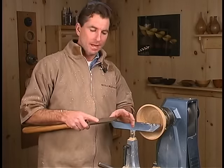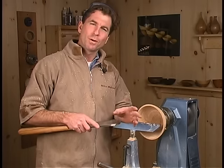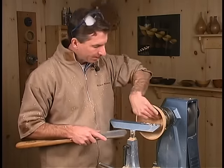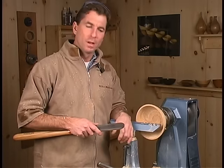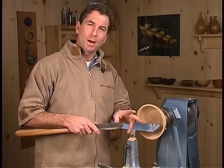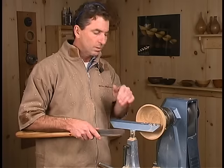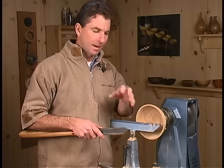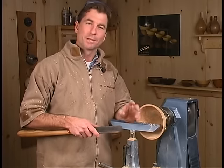As reluctant as I am to use this tool, I feel it's an important tool if you haven't spent a lot of time behind the lathe. It's great for blending in the curve here at the bottom of the bowl. Now, as you'll see in our next couple of projects, we'll neglect to use this tool and we'll go to gouge cuts, because I feel it's going to give us a better curve and a nice clean cut surface, and we won't have to sand as much.